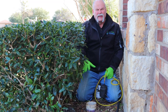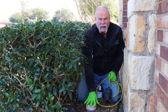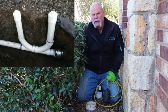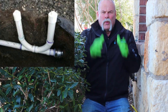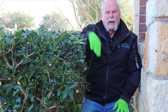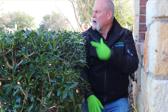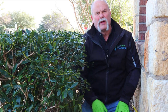The sewer water test starts right here at the two-way cleanouts. We're going to take a test ball — I've got a cleanout here that goes down and towards the city tap, and I've got one under the bushes that goes down and up under the house. That creates a U-shape, so if you've got a stopped-up sewer just under the edge of your house you can go in one direction, or if it's from here to the city tap you go the other way with your sewer machine.